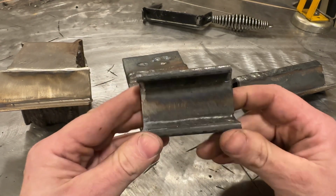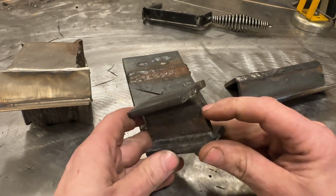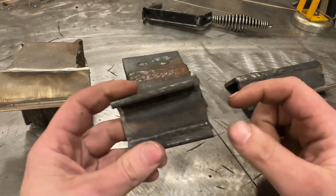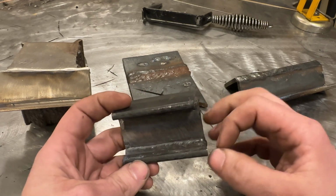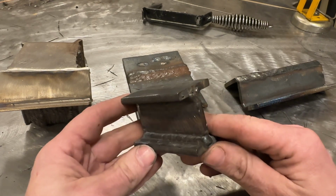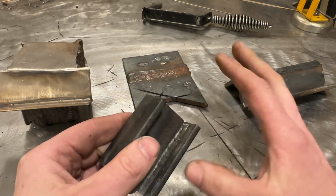Well, anyways, a single pass weld like this is arguably not thick enough for this 1/4 inch plate. To make this weld thick enough to have full strength on a single sided weld like this, as opposed to welded both sides, on a fillet you may have to do 3 passes, depending on what rod size, or use a bigger single rod. Well, you can practice doing multiple pass welds doing a fillet weld, or an easier way for starting out,